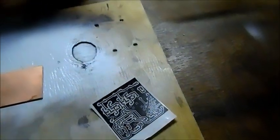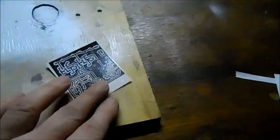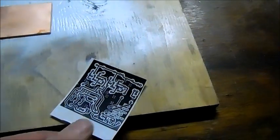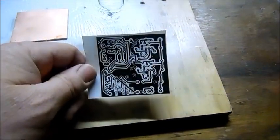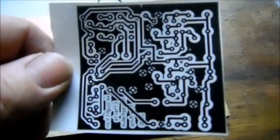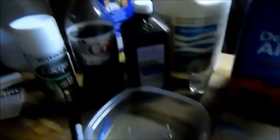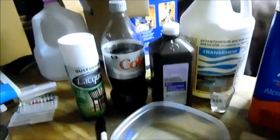A piece of copper clad. Print your design off on that paper. Use a thick glossy paper setting on your printer if you've got options like that. I use a Samsung printer — you can see it prints really nicely, sharp and crisp. I've got a Brother laser printer, an older one, and it ghosts a lot — the toner comes down. Brother printers are kind of known for not being the greatest for toner transfer, especially onto the slick paper.